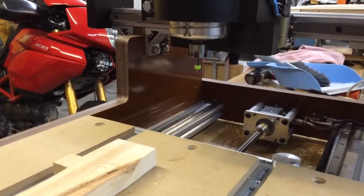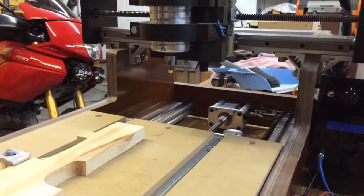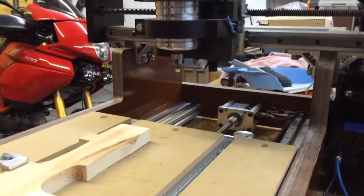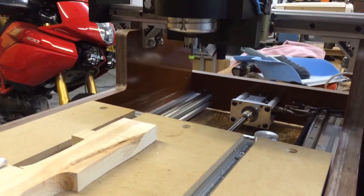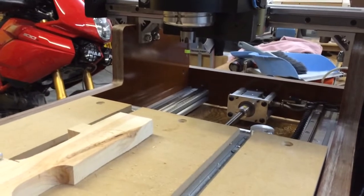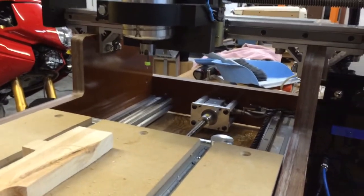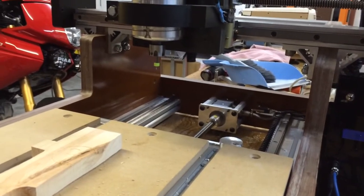The operation in my G code includes a park. Machine is parked, and we are finished. Next time, all we have to do is zero and pull up the G code and run it. No more probing, nothing else, and the only time it'll probe again is if it gets another tool change, because everything else is set unless I lose steps or stall a motor or something like that.